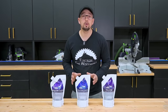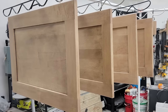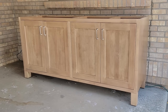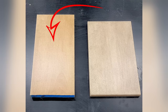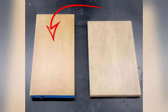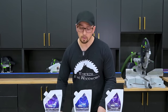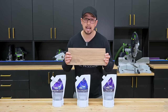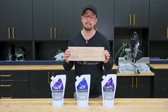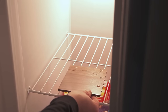The line of products that I'm choosing to test are the Halcyon Clear products. I tried the clear satin on a recent project since I needed an exterior grade finish, and I was surprised to see that it ambered the wood like an oil or solvent-based finish. I've never seen this from a water-based product before, so I couldn't help but wonder what it might look like on walnut. Since walnut is the high-maintenance problem child it is, it'll be a perfect way to test these finishes to their limits.